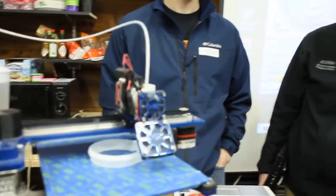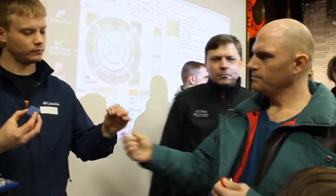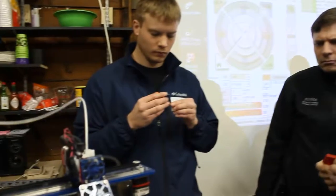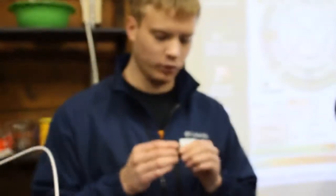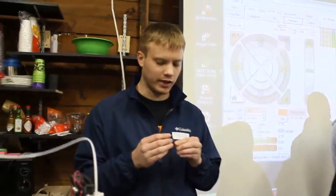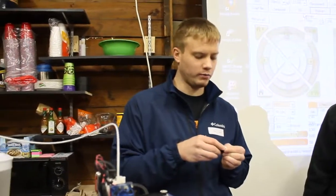I wonder about something like this — this part is hard plastic, but the connectors are a little softer. If it was all stiff, I don't think it would work quite as well together. If it is two different plastics, you could use two different plastics. This part might be better as a more rigid plastic that's not going to bend, but maybe the connectors could be a nylon that would have a little bit more give to it, so when you insert them, they would fit well.